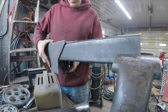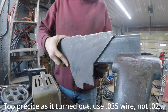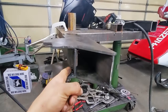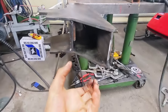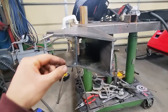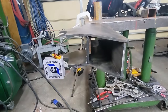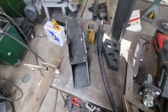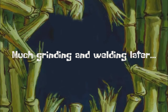Now this is the reason we did it like that — we have a nice precise step. I am kind of concerned that when I weld in here and along here things are going to warp on me. So I think I'm going to weld very short segments and let it cool down in between and see how close we can get. It seems I got a little greedy with my tolerances — it goes in there and gets tight. Much grinding and welding later.